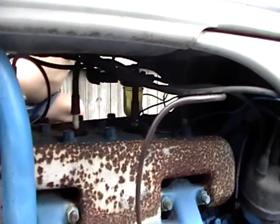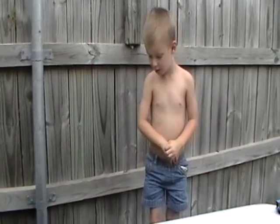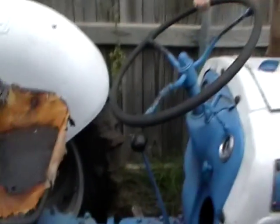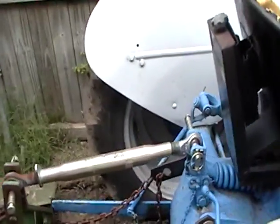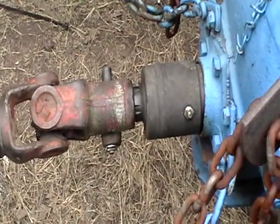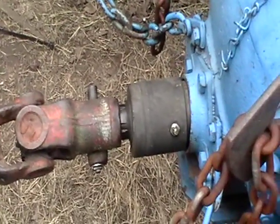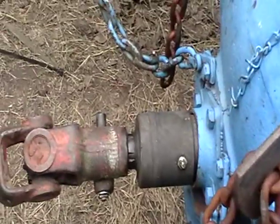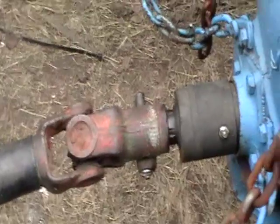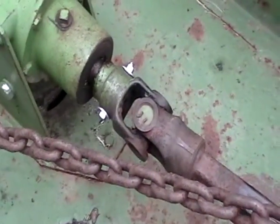I asked Brock to start it up for us. While he's doing that — I got the new slip clutch PTO, and the guy who had it before me just had a whole bolt that went straight through it. But this one has a roll pin in the center of it, so it allows the grease to go through. And I got bigger shear bolts on there too.